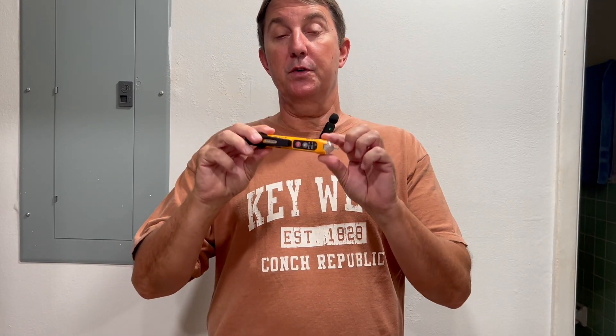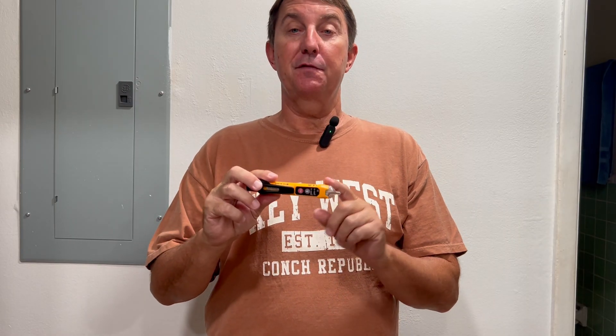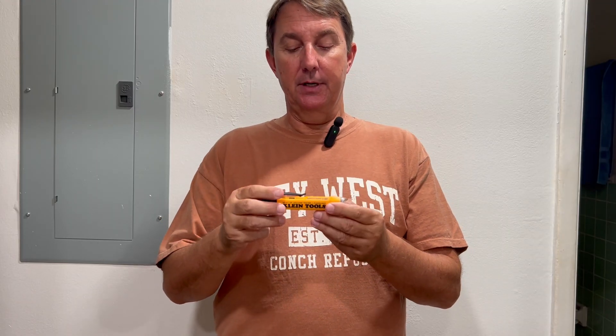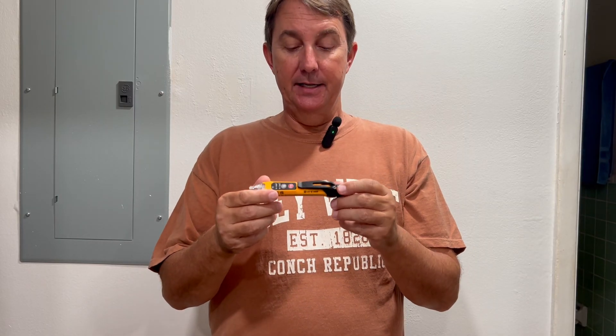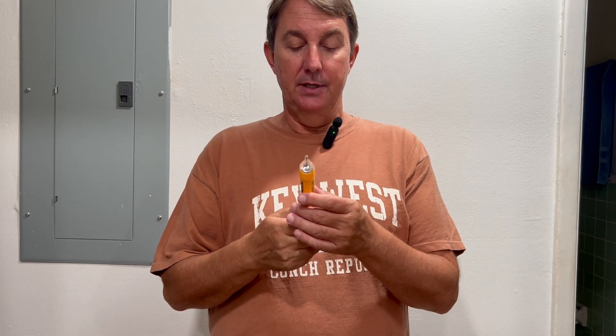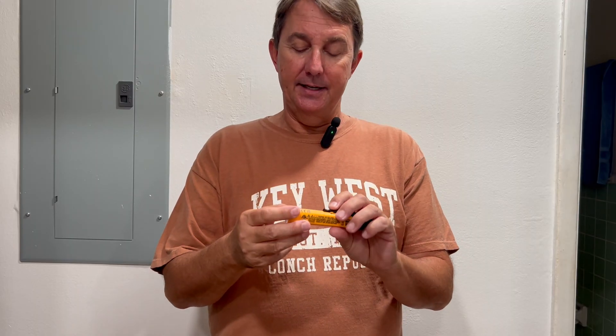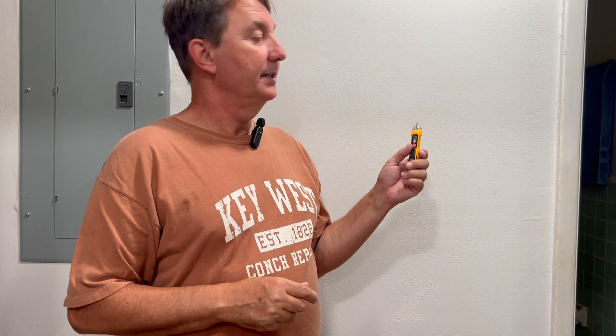If you want to purchase the kit, it comes with four tools — it comes out of the Klein Toolkit CL120VP. I'm going to put a link in the description for the whole set and a link to just this one non-contact voltage tester. It's very handy. Some electricians don't like these things — it just senses the presence of voltage, doesn't give you any numbers. You have to make sure this is working — always test it on something that's known to be on. Make sure it works, because if the battery is dead and you check for voltage and go 'there's no voltage there, we're good' — that's where the error happens.